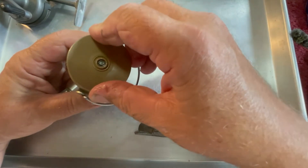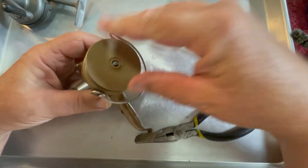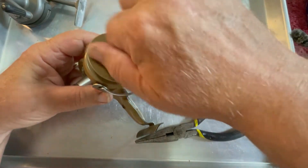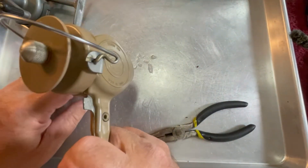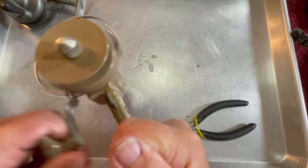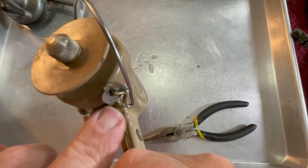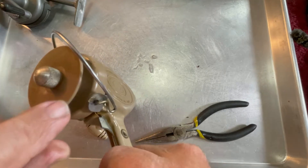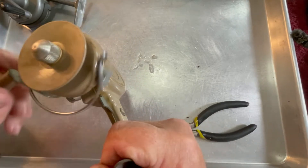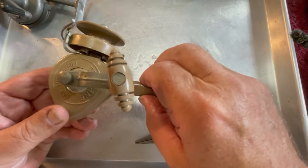I'm going to take this around until it's lined up on the shaft, then slide it down. So we were able to service this a little bit and actually fix it. Somebody had the bail wire on backwards. There's a ramp over here that this piece is supposed to ride on — it's supposed to trip it down and make it drop into place, but the piece wasn't going down the ramp. There we have the Trimline Trim Sport 450, serviced and running.